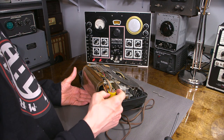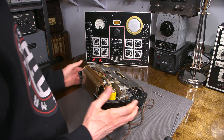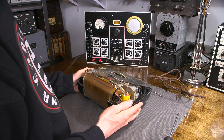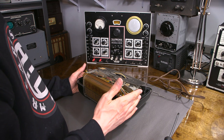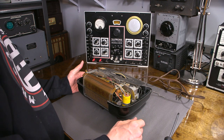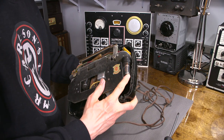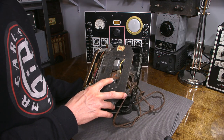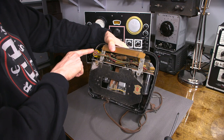It does look like somebody in here has replaced this capacitor - these look like they've been soldered onto terminals that have been taken off on the top here. The engineers were intelligent when they put this together because they put the electrolytic capacitor out of the way of the heat, over here right above this big tuning capacitor. Most of the heat is going to be right above the audio output tube and the rectifier tube. They mounted that cap way over here in the corner - which was a smart idea.